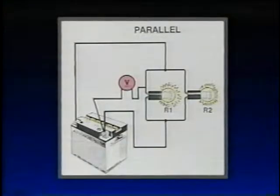Let's move to the wall chart to demonstrate how to attach a voltmeter into an operational circuit. When attaching a voltmeter, we must always hook it in parallel to the circuit that we're testing, attaching the positive lead to the power and the negative lead to an appropriate ground.